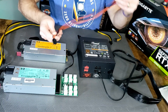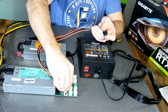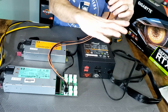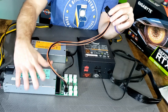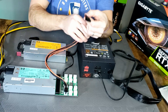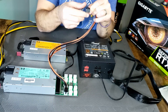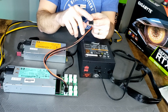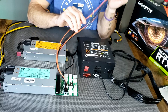Next, we are going to run our PCIe power cable from our breakout board up to either our risers or to our GPU or to both. I personally have always run all of my GPUs solely off the server supply, and then I'm running the risers off the ATX. Many people probably run both the riser and the GPU off the server power supply, and then everything else in the system runs off your standard ATX. So this is a 6-pin — it runs up and this one is running into an 8. From this 8, this carries quite a bit of wattage. You could actually split this into a dual 8-pin or a dual 6-pin, and then you could run a single GPU that has two 6-pin or 8-pins, or you could run a single 8-pin to the GPU and run the other 8-pin down to the riser so that you're powering both off of one cable.